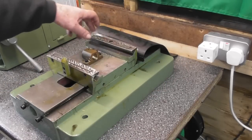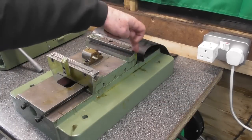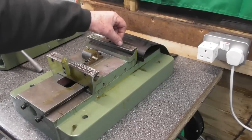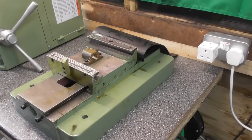This surface, which is the smaller surface — the table is obviously a lot longer — won't wear as quickly, but this small area here would wear very quickly if it wasn't getting properly lubricated. So I'm going to slightly round all the edges of this oilway, which is supposed to transfer oil across the entire surface.